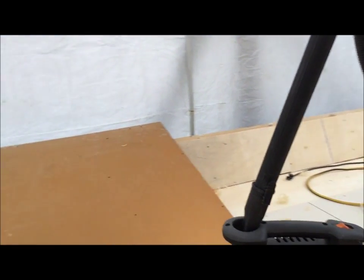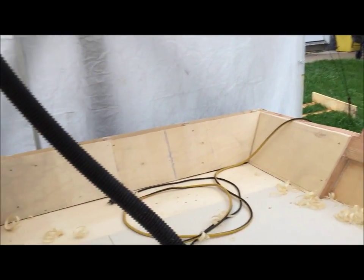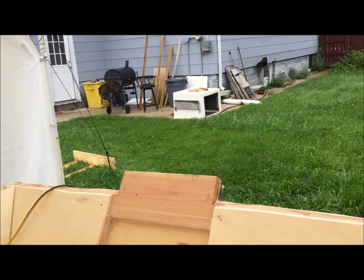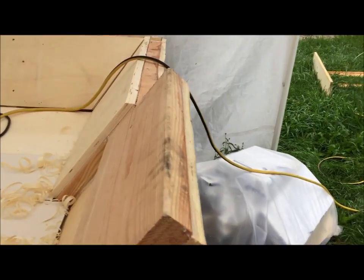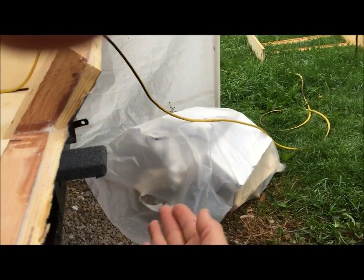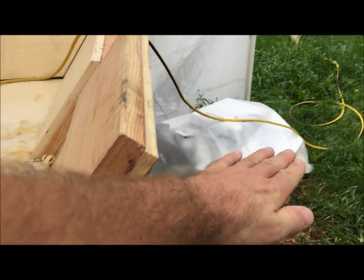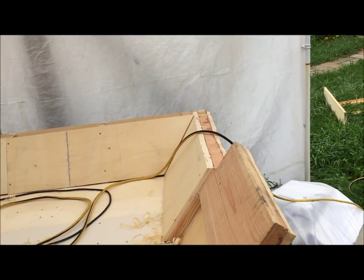What we're probably going to work on today - since I don't want to risk water leaking inside and getting into the lower hull, I'm just going to leave the floor as it is right now. We are going to cut the top of that motor mount off like I talked about the other day, and then we're going to start building the motor bracket. We're going to frame it out of 2x4s, come out straight this way, down, and then angle it back into the boat and make it a sealed box. The top will be open for now, and when we put the deck on top of the boat we'll come out and tie it into the top of the box, making it 100% completely sealed for additional flotation.